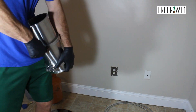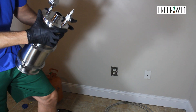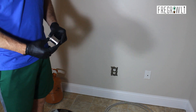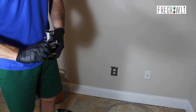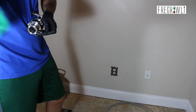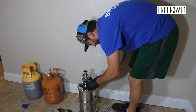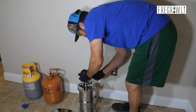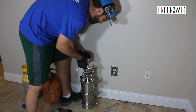As with most of the passive closed-loop system process, dry ice is a necessity in recovering your solvent efficiently. I recommend finding one cooler just big enough for your CLS and another one big enough for your recovery tank. The smaller cooler will allow you to use just the right amount of dry ice instead of not having enough to properly cover your equipment. While I purchased my coolers from Amazon, I noticed they were a couple bucks cheaper at Home Depot, so definitely shop around before just assuming Prime is worth it.